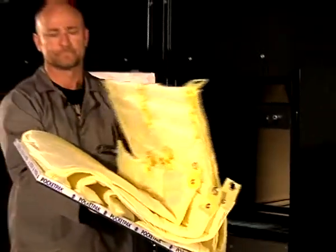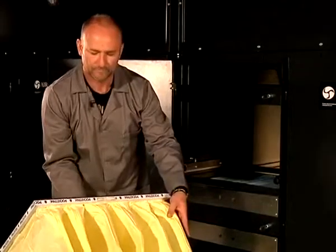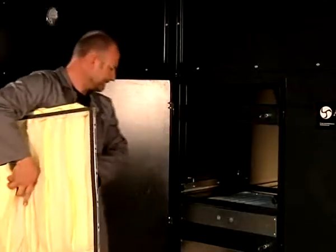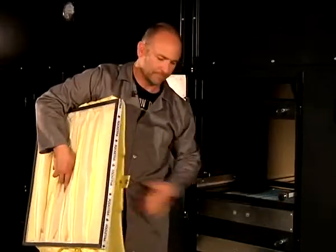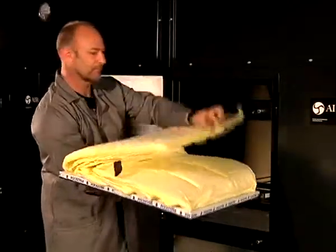After installing your oil-wet fiberglass pad filters, you will need to install your pocket filters, which look like this. Release the slide clamping mechanisms by pulling both of them out. Ensure the fold is left over right before sliding the pocket filter carefully into place.